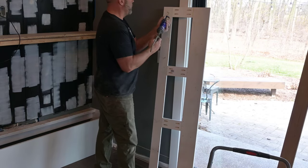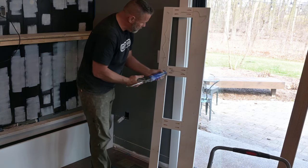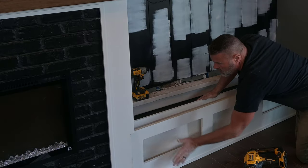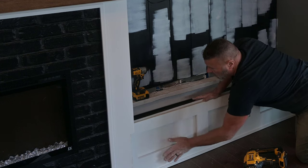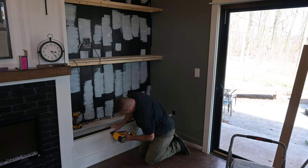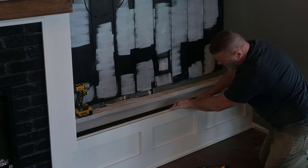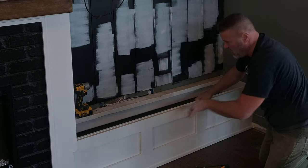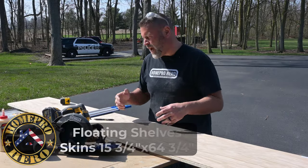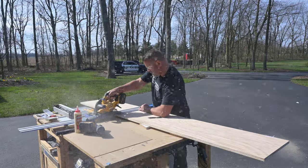We're going to put this on the front of the bench using liquid nails to make sure it stays on, and tack it on with the 18-gauge nail gun so it doesn't fall off overnight. By tomorrow, there's no coming off. I cut it a little bit lower than the box — dropped down about an eighth of an inch. My rough opening is 64, so I'm going to cut them down to 63 and three eighths. Hopefully they'll fit — it's been a tough project when it comes to stuff fitting.